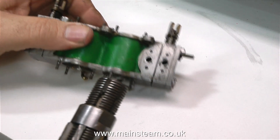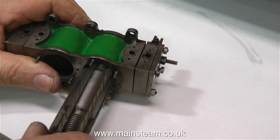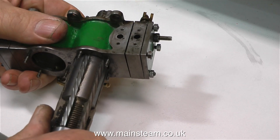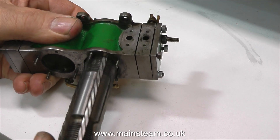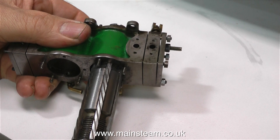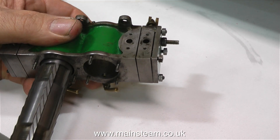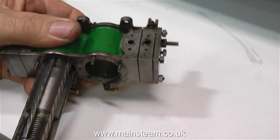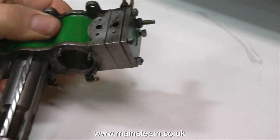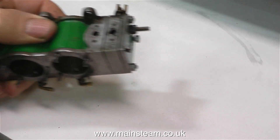Of course there are two cylinders here and this will also make them both the same size. The first thing to do is a dummy run on the bench — this is a feel job, not using any measuring equipment other than my aptitude for feeling things. At the moment I'm just finding out how the reamer fits: in one cylinder it nearly goes all the way through but gets a little bit tight at the top, which means that cylinder is bell-mouthed, caused by the machining operation — possibly the lathe being out of adjustment or the boring tool moving during cutting. When I put the reamer into the other cylinder it's a different story: it's tight and hardly goes in at all, tightening up again towards the top. So we have a situation whereby both cylinders are bell-mouthed and one is smaller than the other. Great.